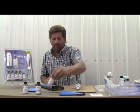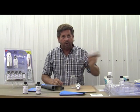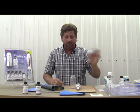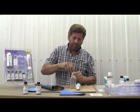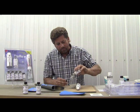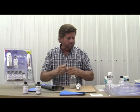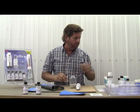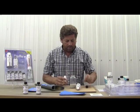And that will be the ACU light tan. And now, once I get that rattling ball going, there it goes. Now, I gotta shake for about 3 minutes. Okay, it's been about 3 minutes. We'll take the cap off and pour about 2 ounces into the pre-val jar. Put my cap back on and set that to the side. And then add my hardener, which will be about a teaspoon.